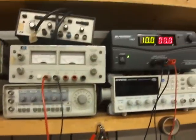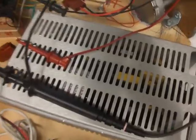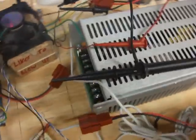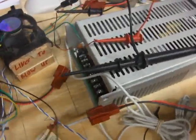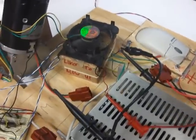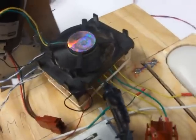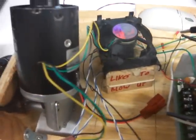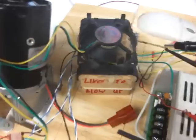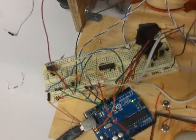I've powered it to 10 volts for the moment. We're gonna use this 24 volt power supply later, but for now I'm avoiding it because it's not current limited — I've already blown up two transistors because something was faulty or overheated. So I'll use the simple 10 volt supply with current regulation so my transistors don't blow up.